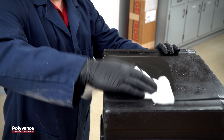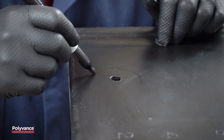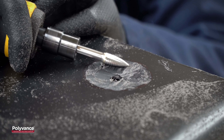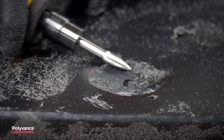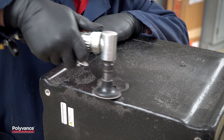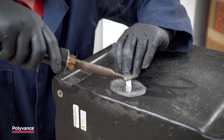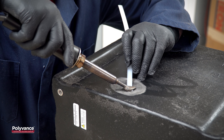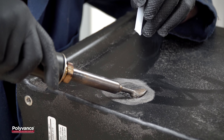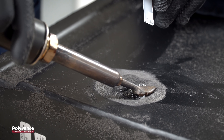First, clean the plastic with Eco-Prep Plastic Cleaner. Although not shown in previous segments, sometimes it's helpful to draw a circle around the hole as a guide for making the bevel. Use a die grinder to make a gradual bevel around the hole using the circle you drew as a guide. Use 50-grit sandpaper on a roll-lock disc to roughen up the beveled plastic. Melt the surface of the rod with the airless plastic welder, flip it over, stick it to the plastic, and force it down into the hole. Do this a few times to build up the plastic and force the melted plastic into the hole, causing it to mushroom out, forming a plug inside the hole.